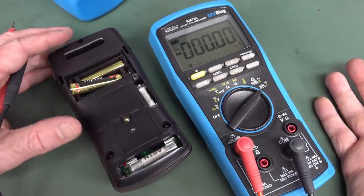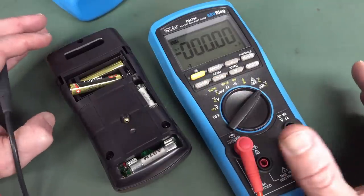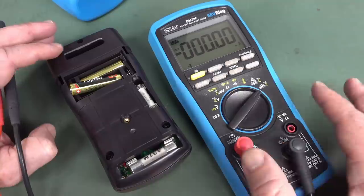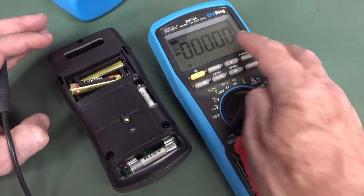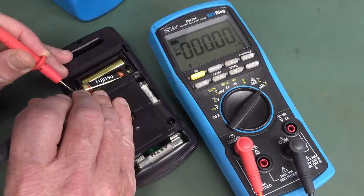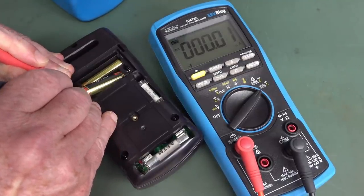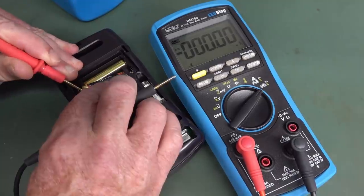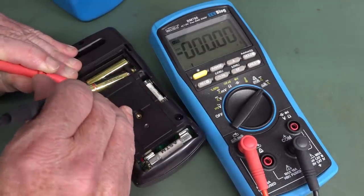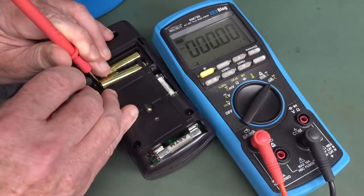We don't need to go get something like a microcurrent meter because a really low power device will take in the order of microamps. An ultra low power micro might operate at like hundreds of nanoamps. If you get down into the 10 nanoamp region, then you're really ultra, ultra low power. I saw something down in the least significant digit there, but I didn't see any jump. So obviously there's no capacitance on the input charging up. There's just absolutely nothing there.